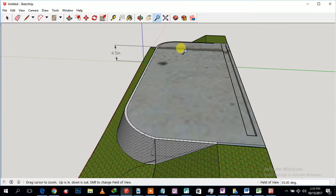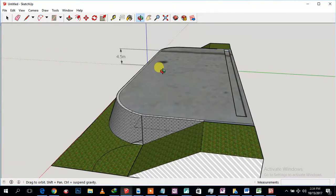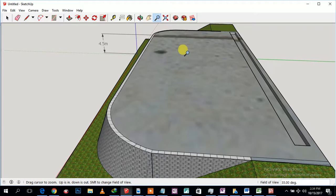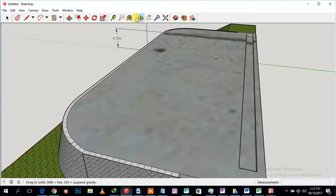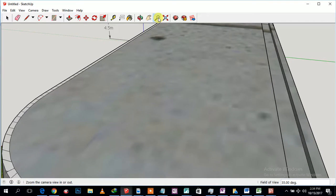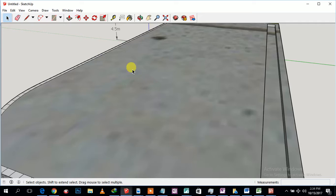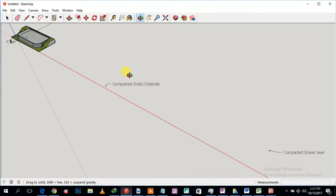Okay, Lani, welcome back. What I was trying to explain is this drainage, particularly the location. We could distance it, so you see this channel here is where the water is going to get captured. You see how permanent it's going to be. We're going to pave this, and then put our drain channel behind the wall, and the pipe we can locate somewhere here as the exit. If we do that, Lani, there are no chances of failure in future for this wall.